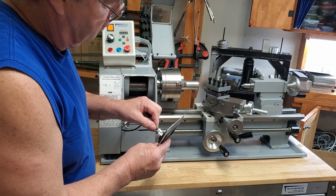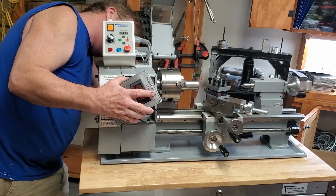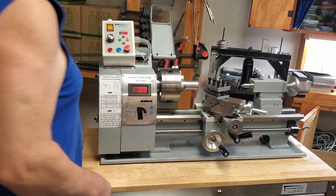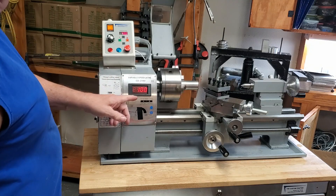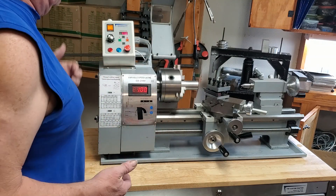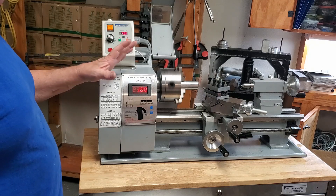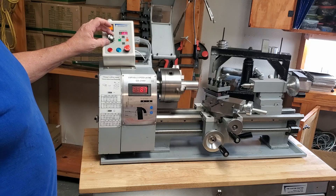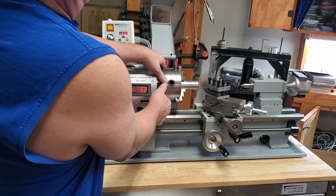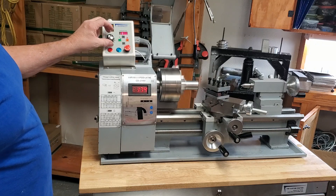Two plug, three plug — screw this in right here. With the belt drive in the low range, spindle's turning 100 RPM, motor's turning 400 — that's 4:1, four rotations motor to one rotation spindle. That's going to be astronomical torque. Slowest speed I can achieve on the spindle is 52 RPMs — it doesn't speed up and you can't stop it. High speed I can achieve on the spindle — there's still a little bit of noise here somewhere.